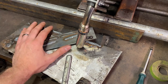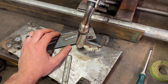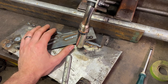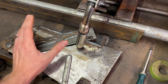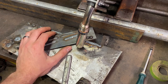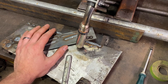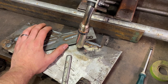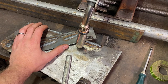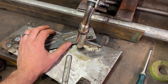For mild steel welding, get some good quality ER70S-6 wire from a reputable supplier - don't pick up cheap wire off eBay as you don't know what it is. If you're welding predominantly under 200 amps, I'd recommend 0.8mm wire. 0.6mm is an option but can present a whole heap of problems and isn't recommended for starting out. For gas, I'm using 10% CO2 argon mix. For material up to 5-6mm, anywhere between 5-15% CO2 argon mix is recommended; beyond that a 25% CO2 argon mix is sufficient, which is what most fab shops use for general work.